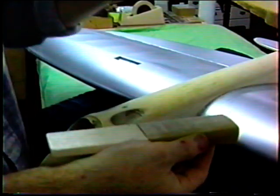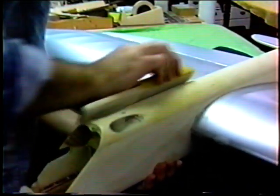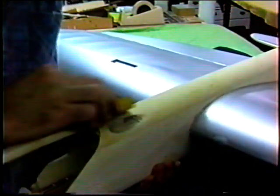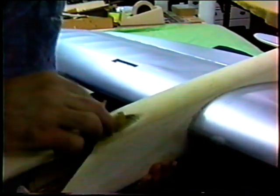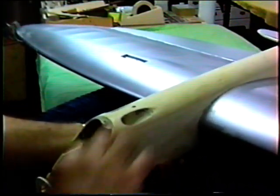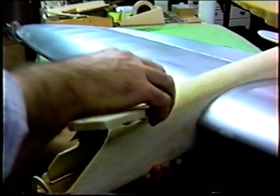When you see glass come off like powder like this, boy, it is a joy to sand. You get a beautiful velvety finish in a matter of minutes. It's unbelievable. The whole secret is let it dry. Give it a couple days to dry. Schedule it in that way. Even the edges here dried up beautifully. And make sure I get all these edges radiused.